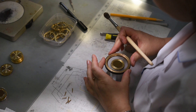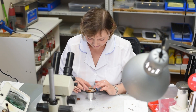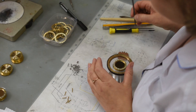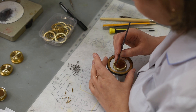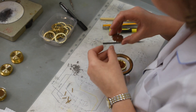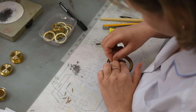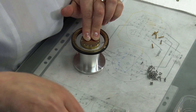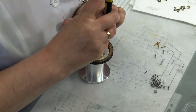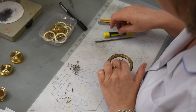The components from downstairs and the preparation area are now introduced into the assembly station. The back plate is first placed onto a jig where the diaphragm is introduced and the capsule ring is placed over the top. This is very carefully lined up by a skilled technician who uses a jig to make sure all the screws go in the right order and in the right place and direction. Depending on the capsule being made, it could be a single diaphragm or a dual diaphragm.